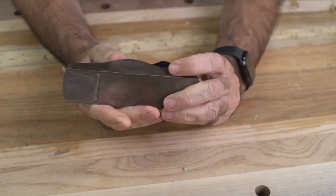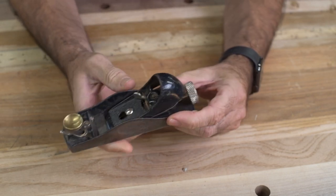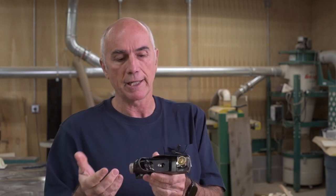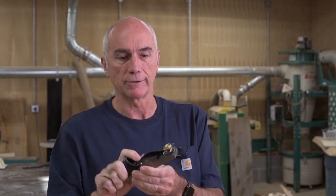This is the only one I've ever held in my hands. Next up, we have a Stanley Low Angle Block Plane. This is a model 60 — it's identical to the 60 and a half except the lever cap on the 60 and a half is nickel plated. It's got an adjustable throat, it's a low angle plane, bevel up. I'm not going to get into the bevel angle debate, but I just like this one because it's quite small, handy to keep around, and it fits my hand very well. Back in 1941, according to my catalog, this particular one would cost you $2.50, whereas the nickel plated one would cost you $2.95. Now you can get them for about $50 on eBay, but they produced millions of these and you can find them quite often very cheap at garage sales, estate sales, and flea markets.